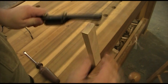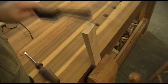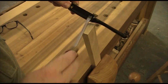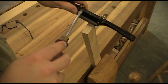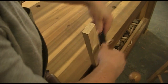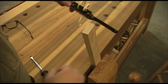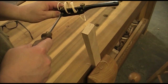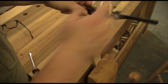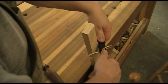A little bit more — I can visually look at it. I'm going to lower this side down a little bit, so I'll tap this side. And I'm getting it now so that I'm taking a fairly thin shaving on this side and a thicker one on that side. At which point I'll tighten it up a little more so it locks into place. If I want to adjust it further, I can loosen one side just a tad, then loosen it totally and re-tighten so it's just barely touching, and tap again — and it takes a much finer shaving on that side.